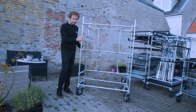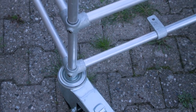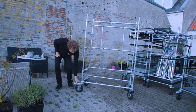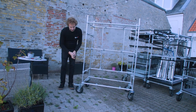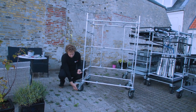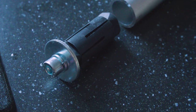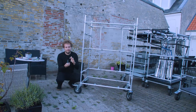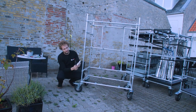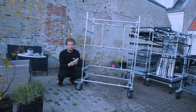You can quickly reach the weight limit of the van. This frame without the plywood shelves weighs exactly 30 kilograms with the wheels. The wheels have bearings so they can swivel, they are air-filled for easy pushing, and the wheel height is around 19 centimeters. The wheels are attached with a plastic mount with a screw on the bottom — you simply push it into the pipe and tighten it, and nothing will come loose. It's a very easy system.